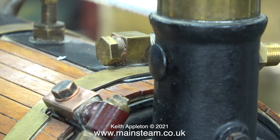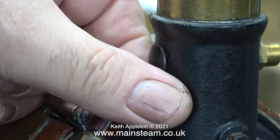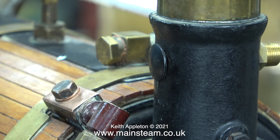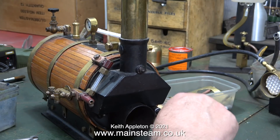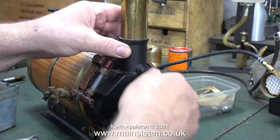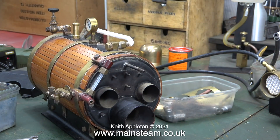I'm going to remove the water gauge for a closer examination. Here I'm taking out the top cap, because this is a scotch return tube boiler - it has a special fitting that holds the chimney, and before I can remove the water gauge I need to take this off. It's held in place with three nuts on three long studs that are silver soldered into the boiler. The fire goes down the tube that you can see the open end of, and it bounces back from the other end of the boiler down these two tubes, and then the exhaust gases go up the chimney.